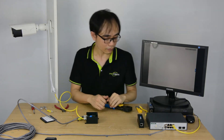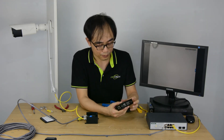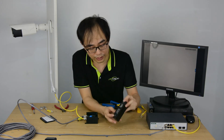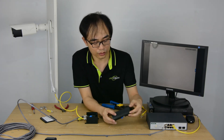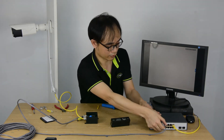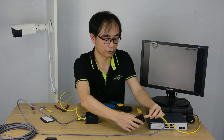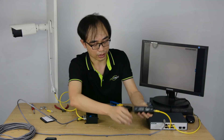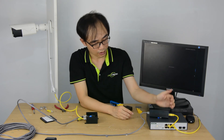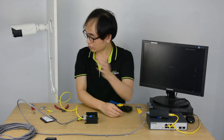If you still want to add an indoor POE surge protector close to the switch, we can use this one — it's pretty easy. There are also in and out ports. For the input, take the cable from the POE switch, disconnect it, and use a punch-down tool connecting to the input. Now we have the output. The cable goes through to the switch. Now both sides are covered — we have a POE surge protector close to the switch and also close to the camera.